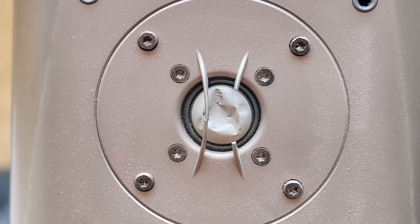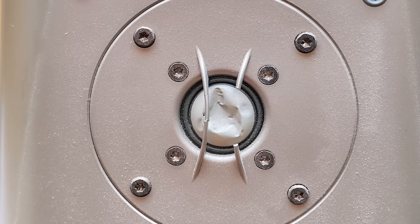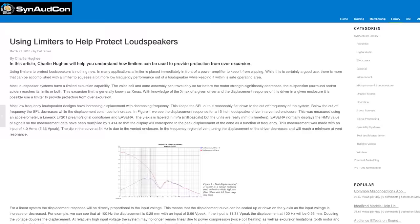And clipping isn't just annoying to your ears — it can actually damage your speakers. When clipping occurs, amplifiers often end up pushing too much high-frequency energy to your speakers, meaning that the tweeter — the part responsible for producing higher sounds — is especially at risk for permanent damage if there's lots of clipping present.